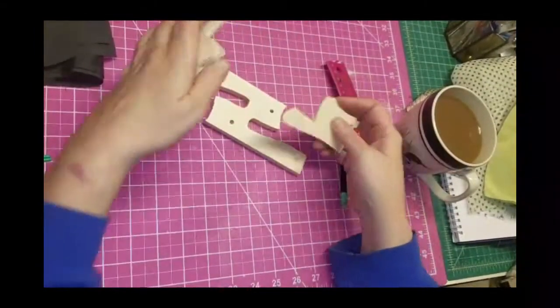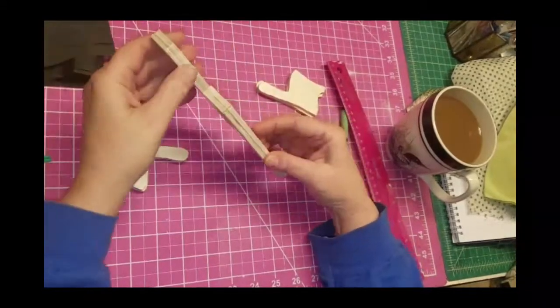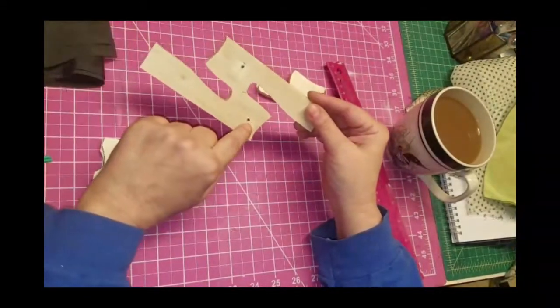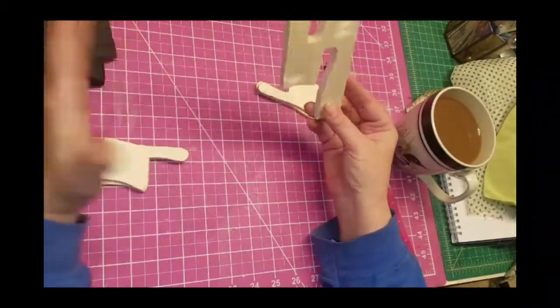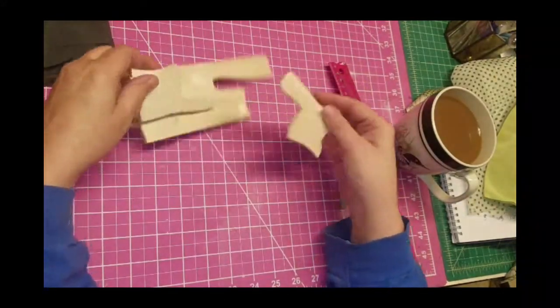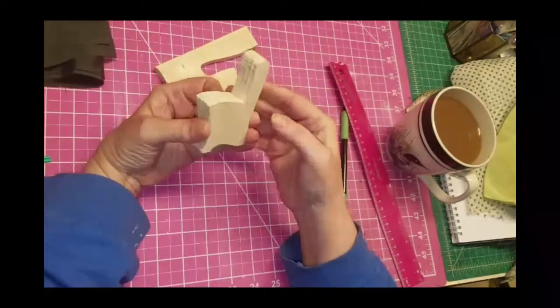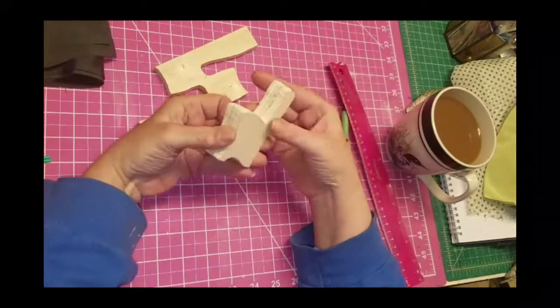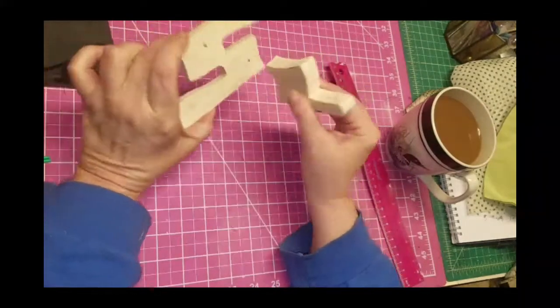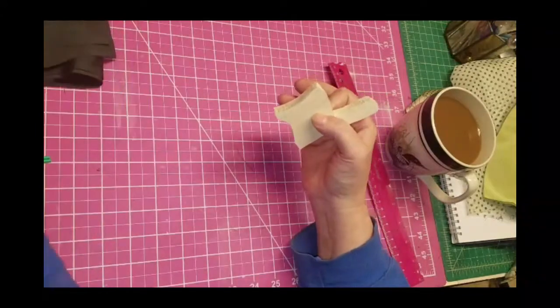This was so much fun. So you saw me draw it out. I went and I nailed the two spots to secure the wood together. And then I clamped it and ground off the end so that it wouldn't get in the way. Cut them out. So we'll put them together to see how we did. See how I did. Just needs a little sanding. And I can use this bit and this bit for framework if I need to.